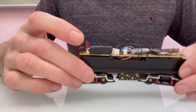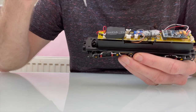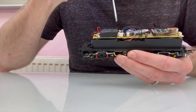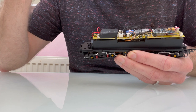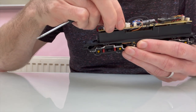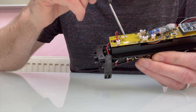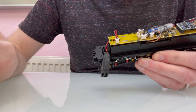But what I was going to show you first is how I did the speaker, so I'll just use this to point with. It's also the screwdriver that I used for the job. So the standard speaker's here, but to take it out, you have to take these six screws out, which hold the circuit board down. And then there's two little brass screws underneath, which hold the speaker. So ignore the four screws that are on top of the speaker, because they won't let you fully take it out. It has to be done from underneath. And then it leaves you with a nice flat area where you can connect the speaker. You can either connect it to the two solder pads which are left on top, which is where the factory speaker would touch against, or there's two pads underneath, which I've used just because I thought they were a little bit neater and it meant not adding any extra height here.